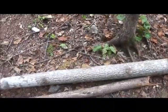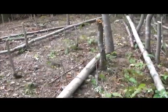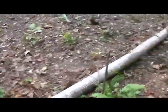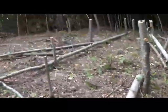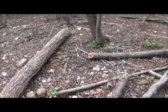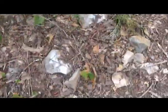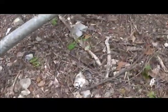These will be steep slopes once it's all dozed out. I'm leaning towards using these hardwoods as little terracing retaining walls - put one in and have the ground go back a foot, put in another one, have the ground go back a foot, like steps. Being hardwoods they should last about ten years, and by then the trees and plants will be grown enough to control the erosion. I also got a lot of stones to use for those little step retaining walls.